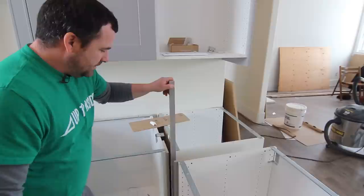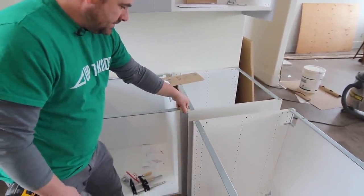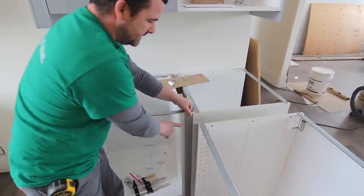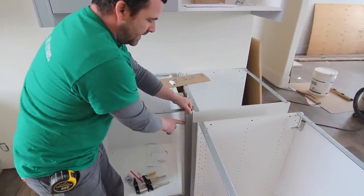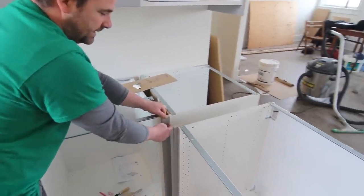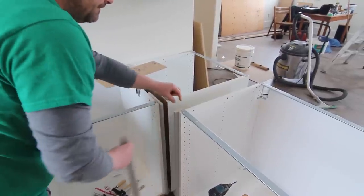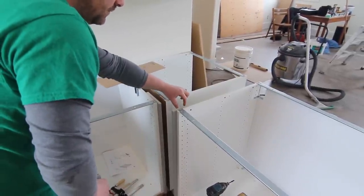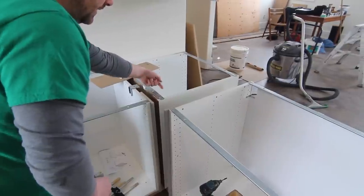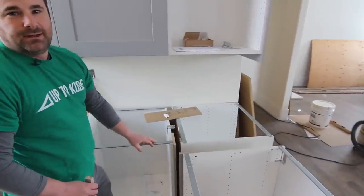Now with Plan B, I'm going to slip this panel down there, take it out, and brad nail it in. Then I'll do this other panel so it butts into here. After that, I'll probably throw some chunks of two-by-four here so I can screw from the inside of the cabinet and get everything to suck tight together.